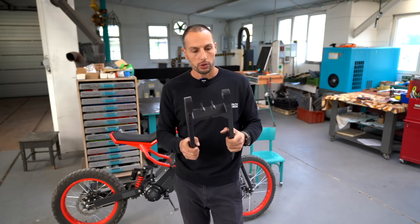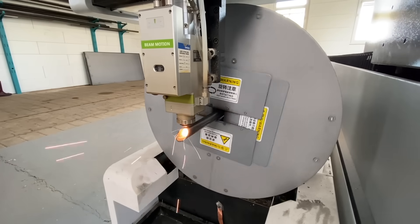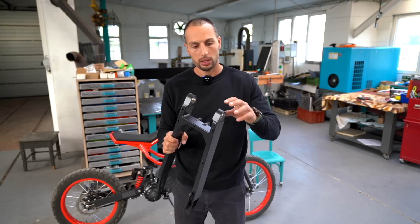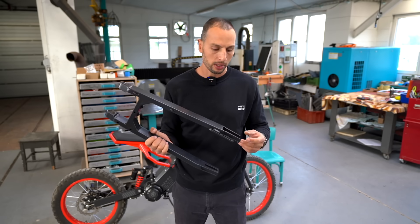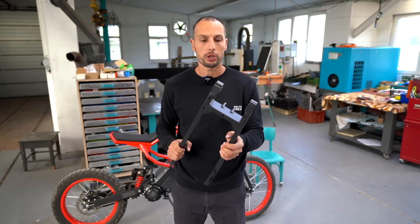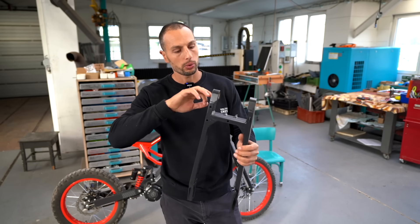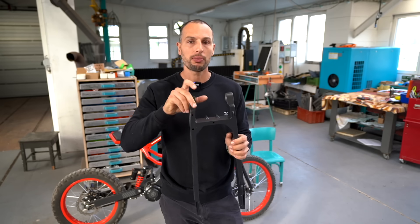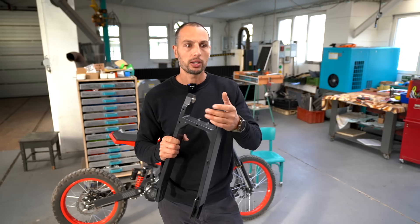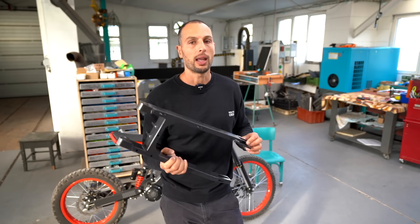In the design phase, swing arms were a little bit tricky for me at the time, but then I realized it's actually pretty simple, especially with a tube-cutting laser. This is standard square tubing and we just CNC milled these parts: the attachment to the frame, the bearing housing, and then the chain tensioners. We started with a little bit bulkier, rougher options, and now this really went through fundamental improvements. We now have caps — this is much beefier, stronger, stiffer — and the bearings are inserted inside, covered from the outside, with seals from all sides. It will always be protected against dust and harsh environments.